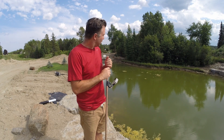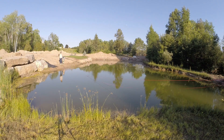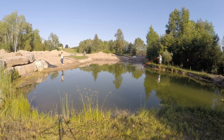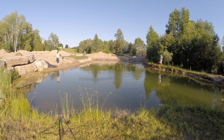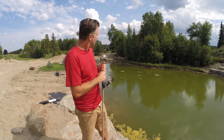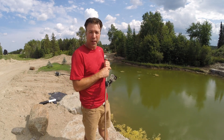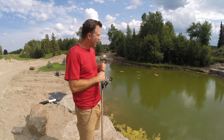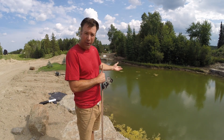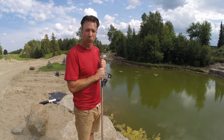Back a day after we got the bubbler in. It was a bit of a guessing game with the rope — just jump in and take it down. I think I'm in the deep spot there. Got the ropes on it and just kind of pulled it in place, then let go of one side and pulled it around. Nobody got wet, not too much yelling at each other. Creating a lot of bubble, a lot of air in there. You can see the algae floating around. From what I've read, you can definitely create an algae bloom — your water can get worse before it gets better. We're putting a lot of air in and moving the nutrients all around the pond, bringing nutrient-rich water from the bottom up into the sun. Don't panic if it gets really bad before it gets better.